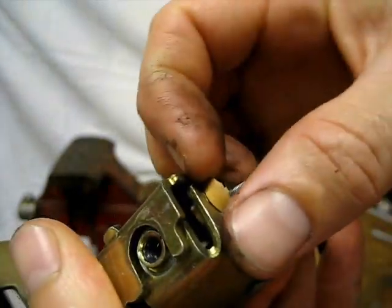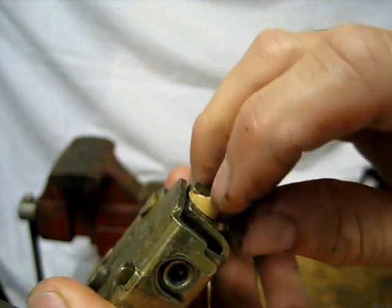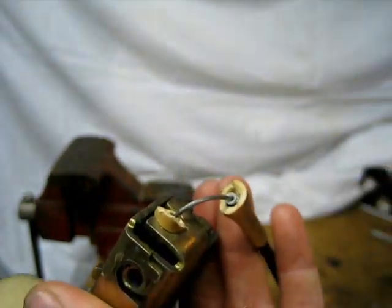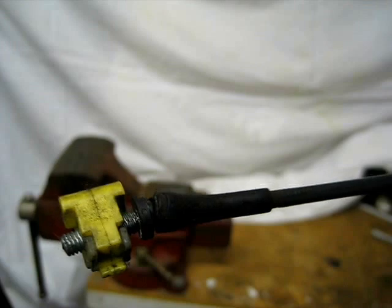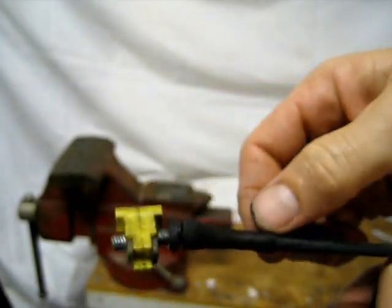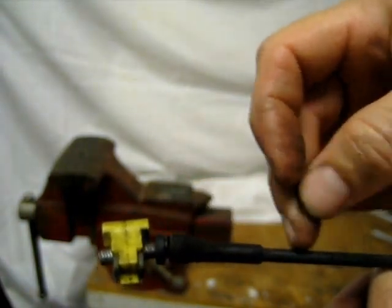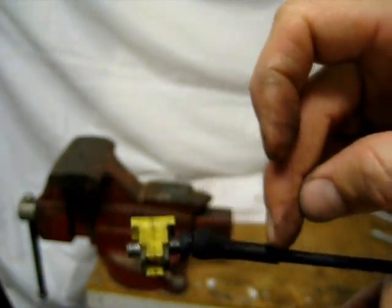Get a screwdriver and break all this out. Most of this is pretty brittle but you'll probably have to use a screwdriver to dig all these bits and pieces out of here. Same thing with the other end. You'll have to get all of this jacket here, this plastic part from about here up this way. Take some pliers and nibble at it so that you're not tearing up the sheathing on the cable itself, but you just want to get all of this stuff off of here.